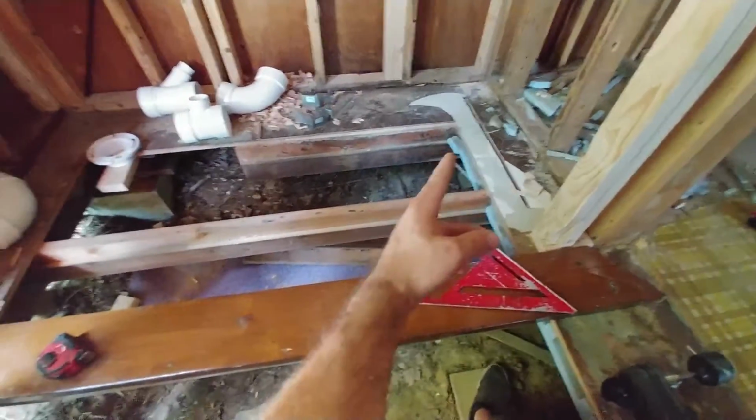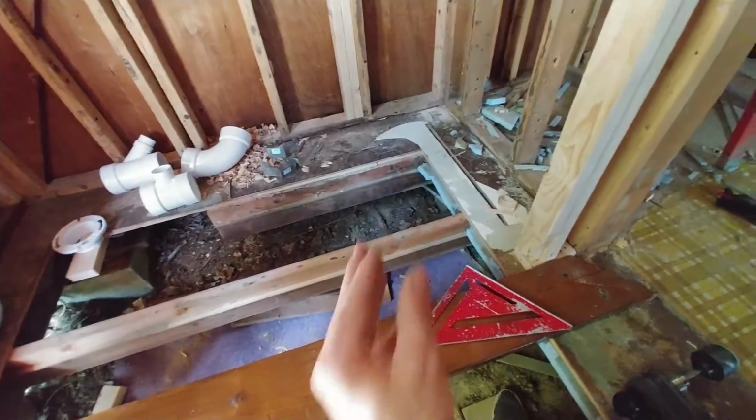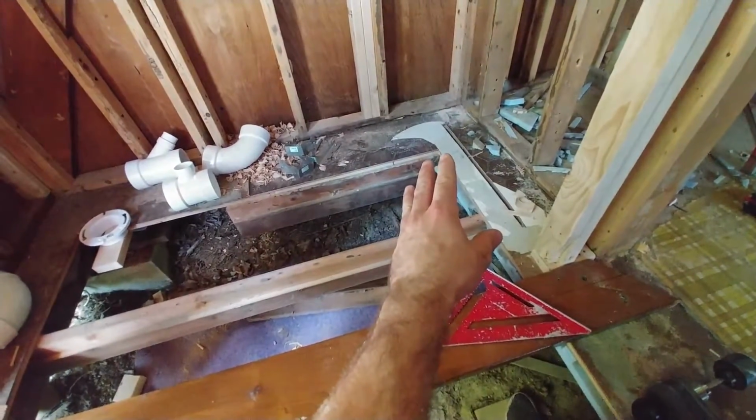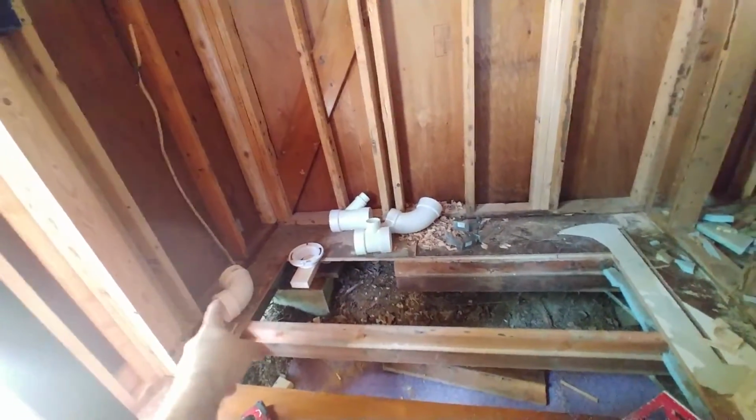I'll go right underneath the shower, so I'll wait until that's all stubbed down and I have that elevation. But I'll shoot for that to come through at fall and catch into that right with a T or a Y I'll have to do there or what have you, but then I can continue over. And our sink used to be over here, and the drain for that was going to have to come down and come over.